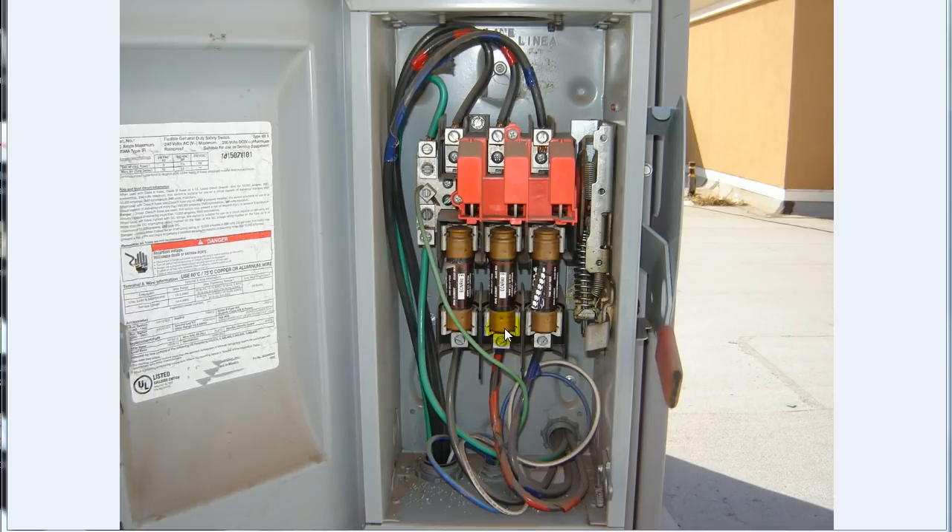One thing that I liked about what these guys did was when they installed their fuses, they put the label of the size of the fuse. On the side of an air conditioner they have a nameplate rating, and they'll have a max fuse size. The max fuse size on this particular unit is 40 amps. So when a service guy, service technician, electrician, or inspector opens this disconnect and sees 40 amp fuses in there, they'll know what to replace or they'll know that it's fused properly.